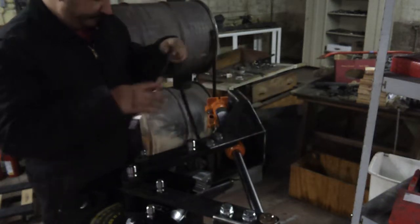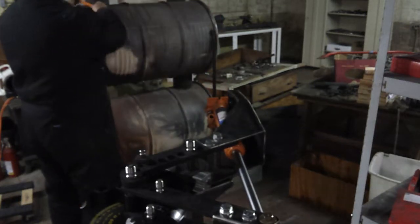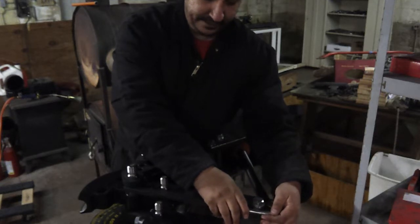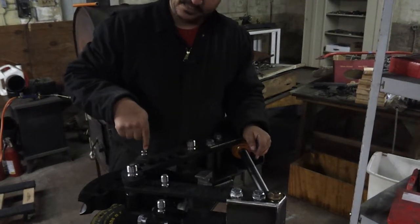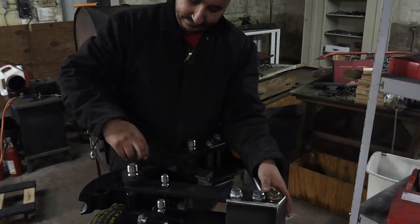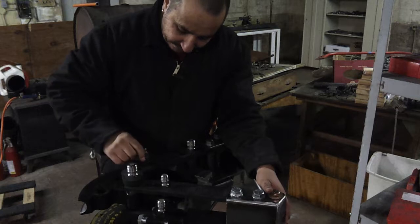Let me just drop this down here and release the pressure. One thing you'll want to know — if I try collapsing this, it starts going and it stops. The reason it stopped is the anti-springback pin. There's pressure pulling on it, so it's not wanting to come out of its hole. So I need to release it, pick this up, and turn it. Actually, let me push that back out there — I want to show you how to re-pin this real quick.